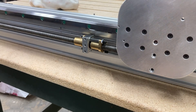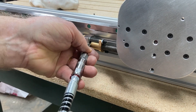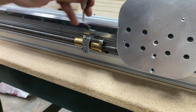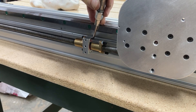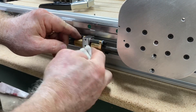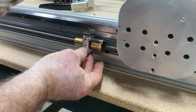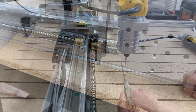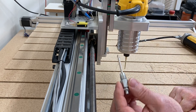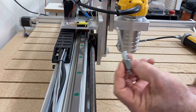Because it's very hard to see on the x-axis, I wanted to show you again on the y-axis exactly where that needle needs to go to have the grease enter — it's right here at this point. On the x-axis, you can get to this point on the left-hand side and the grease gun will just slip right into that point between the brass fitting and the aluminum housing. With this long needle nose adapter, it works really well for getting in there.